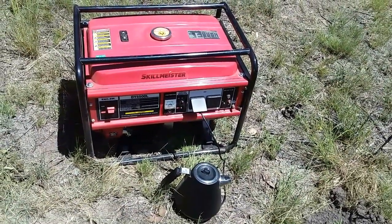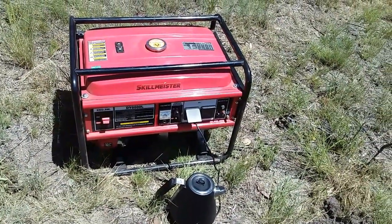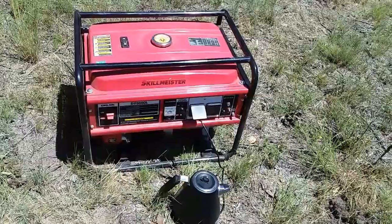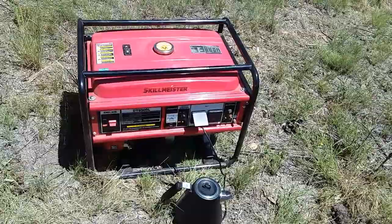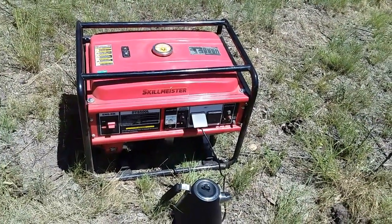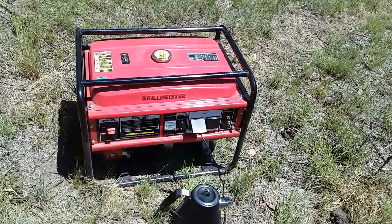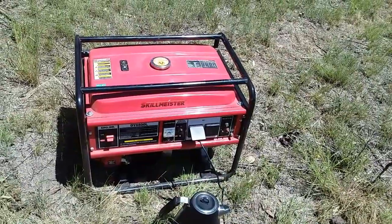researcher out there should already know: that the shaft torque on a generator is entirely a magnetic effect only. Okay, current flows in the wire, creates a magnetic field. As soon as there is a magnetic field, the shaft sees a drag. Now the drag is its opposition, it's a bucking. If it wasn't a bucking, it would assist and the rotor would speed up. The sign is a negative sign, which is basically the same as 180 degrees out of phase.